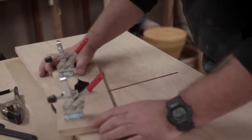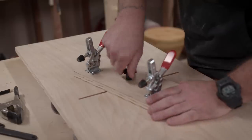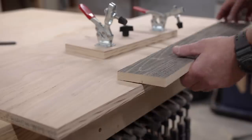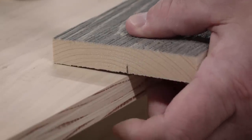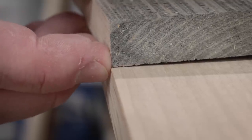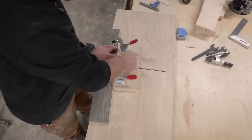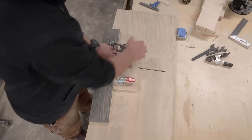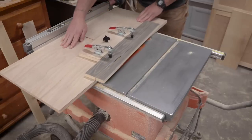You can see the versatility of this thing — you can spin it in all directions for a variety of different uses, some of which I probably haven't discovered yet. For a generic taper, I'm putting a double taper on this piece. I line up my center mark and line up the very edge of the board along where the saw path is going to be. I slide the fence up to it, tighten down the knob, and lock the clamps down. And as you can see, it works like a normal tapering jig.